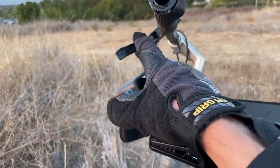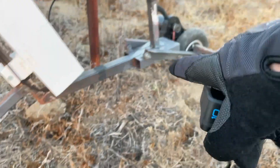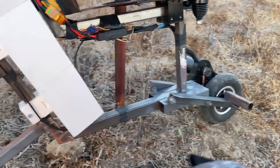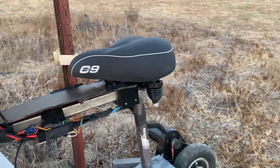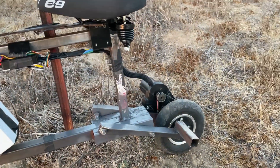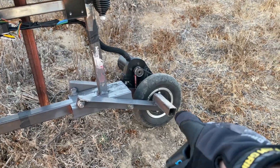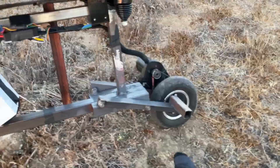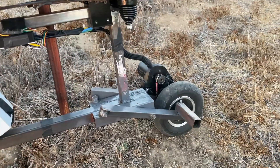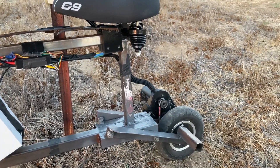I did put a better brake on it which works with the front wheel's drum brake, and I have e-braking on the rear wheel too, so I have dual wheel braking which is pretty good. The seat I bought on Amazon for like 20 bucks — it's super comfy and cushy. There's no suspension on this thing, so all the suspension comes from the little bit of travel in the pneumatic wheels themselves, which is maybe 5-10 millimeters, so the seat cushion actually helps a lot.